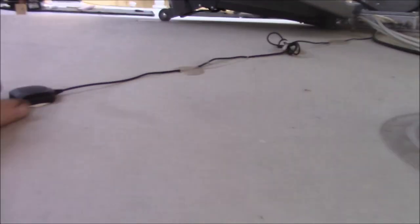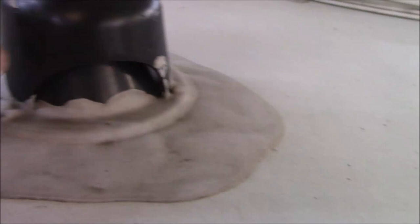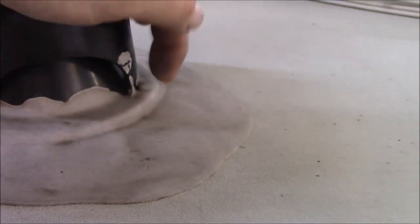Got a big old satellite dish I got to deal with too. And I guess this thing. But if you've got one of these, make sure inside there is sealed. If you have this type of cap, there's a screw right here, a screw here, screw there. Water will get down inside and it'll start leaking. So we get rid of all that anyways. So we're going to make boots for them.